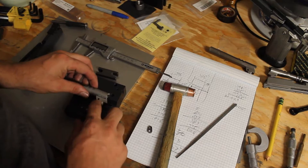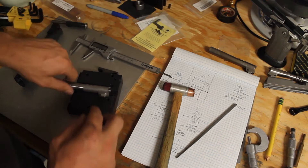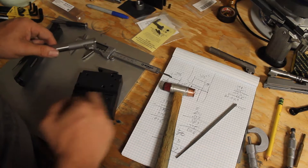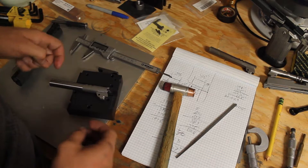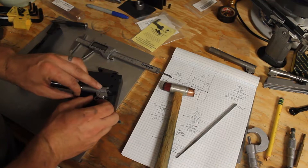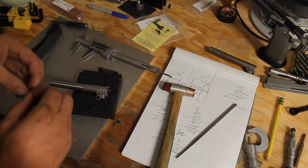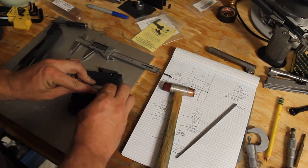Now to start working on the lower lugs, you have to put your link and pin in. This is my first time using this 10-8 block from 10-8 Precision. There are a bunch of holes on here that all serve a purpose — holes on either side for laying your barrel, and this hole right here is for catching your link pin when you drive it out. I'm going to use the same link I pulled off the barrel I'm replacing, because that gun ran great with this link, and as long as we fit everything the same I should be able to use it. I don't need to leave this link in that barrel because that barrel will never see service again.